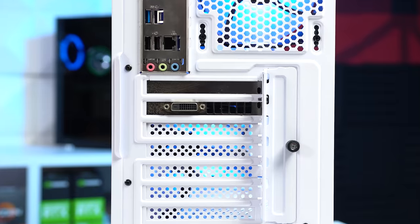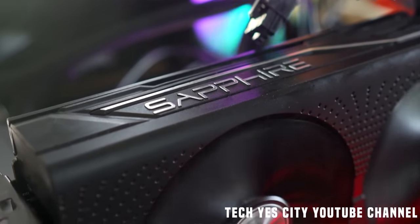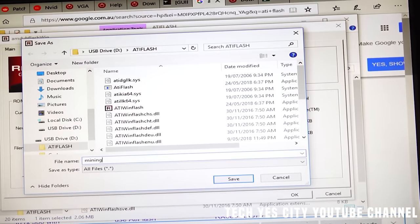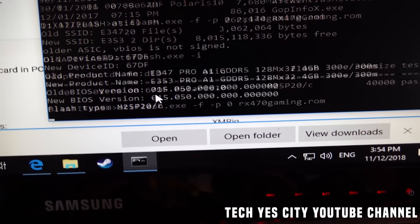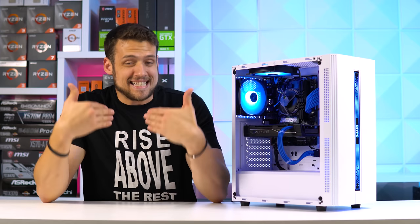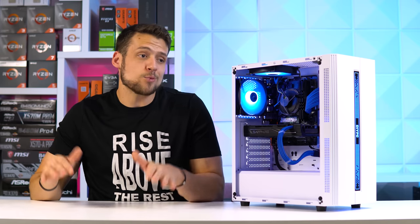Since I realized I had a mining graphics card, I thought this would be a good opportunity to show you how to flash the BIOS from a mining version to a gaming version. I got lucky because Brian from Tech Yes City made a video on exactly this with what I thought was the same mining RX 470. I backed up the original BIOS, downloaded Brian's BIOS, and force-installed it via command line because the Windows GUI tool didn't accept it. My monitor then started displaying everything tripled, and even after reinstalling the drivers that didn't fix it. Thankfully I could read enough text to re-flash back to the original BIOS — and that's why backing up is so important. I later found out Brian and I didn't have the exact same RX 470, and I couldn't even find my BIOS version on TechPowerUp at all. That's where I should have quit.